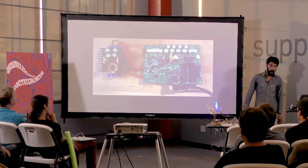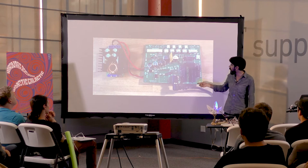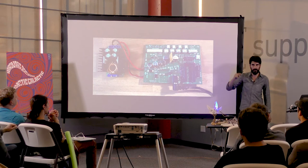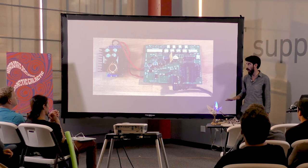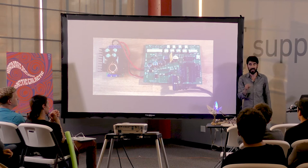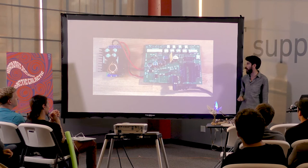Here's the board, designed by Steve — a few interesting things. From the old board, we had screw terminals everywhere. This time we tried to fix that mistake. Screw terminals are not only completely unreliable and come undone, but someone has to screw every single one in. I actually biked here with all this stuff and two or three wires came out. Had everything set up in my office, put it in my bag, biked here, and the wires were gone. So we switched to MTA-100 wire-to-board connectors.